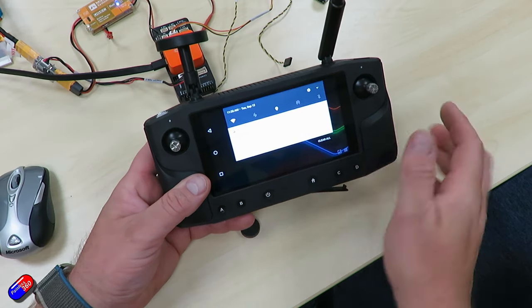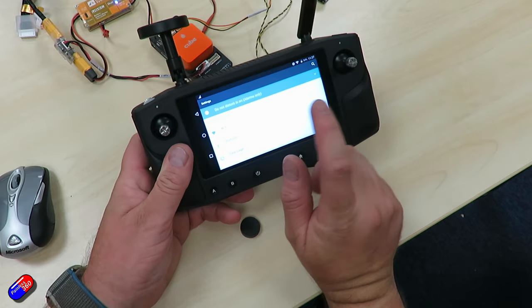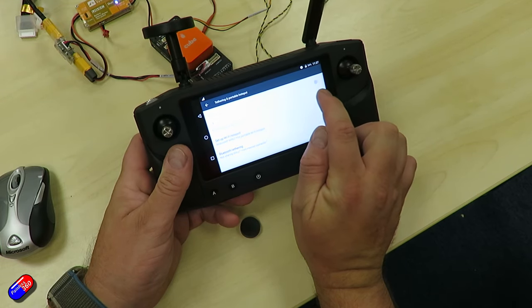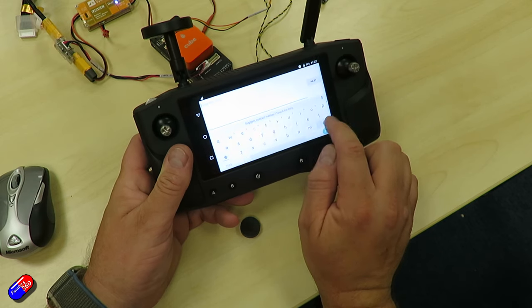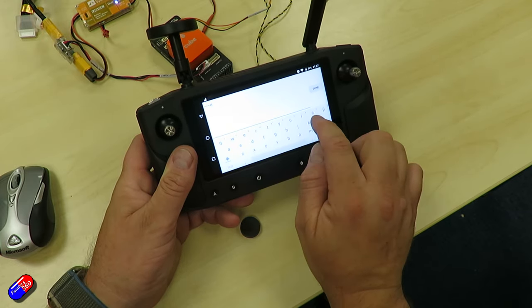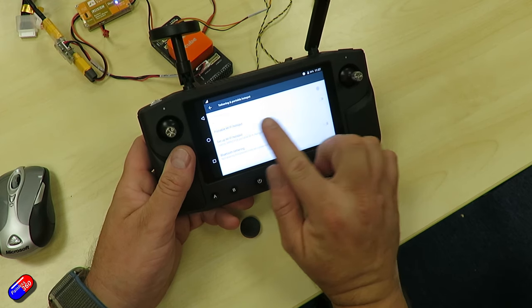Let's swipe down to the Android menu. I'm going to disconnect the USB because we're going to use Wi-Fi — we're fully disconnected from the computer, this is a separate system. Go to Android menus → Wi-Fi → more settings → Tethering and Hotspot → Portable Wi-Fi. Let's turn that on. We need to set this up — we'll call it 'Test HL' for Heerlink. Add a password — it's best to have some sort of password here. This will now start broadcasting a hotspot from this device.